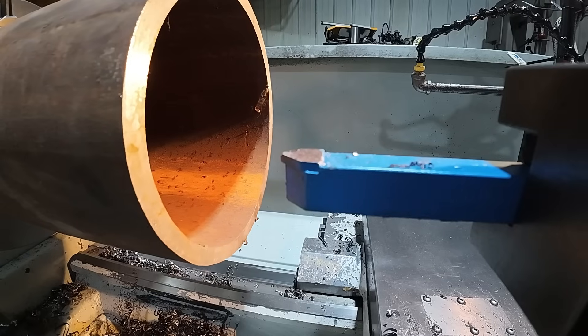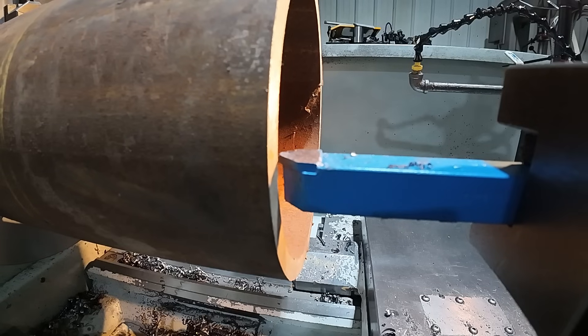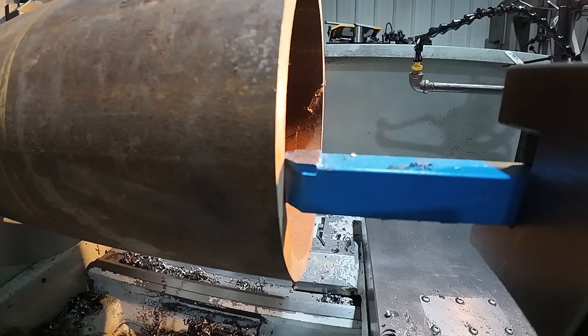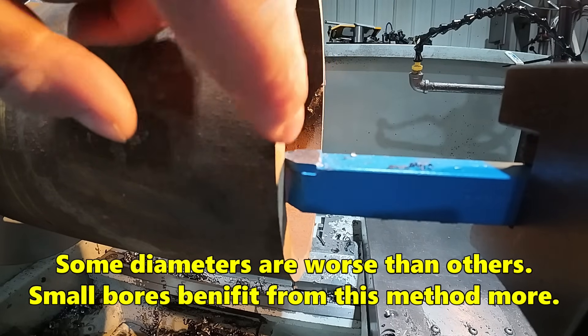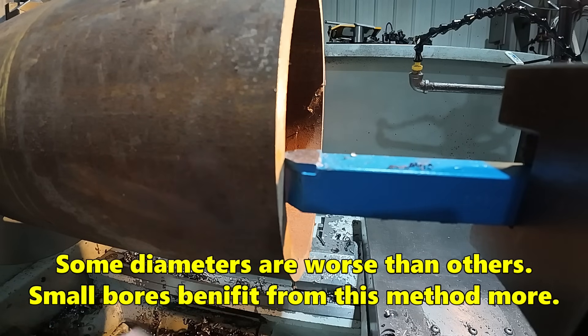In order to demonstrate this, I've had to exaggerate the stick out of my tool a lot. But when you come in — right about there — there I am touching the inside bore with my tool. And I don't have a lot of room here before it'll hit. I'd have to grind out the bottom of the tool to make that work.